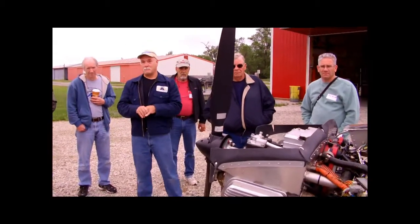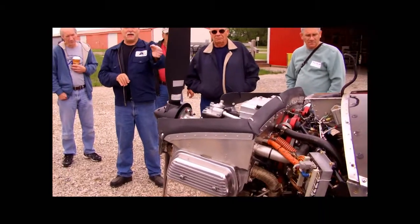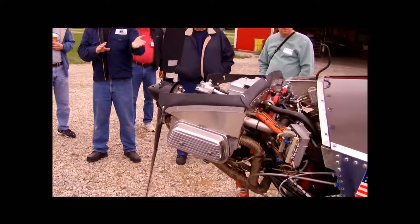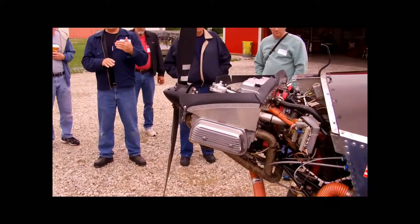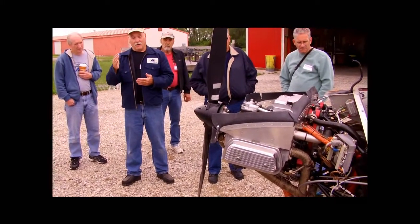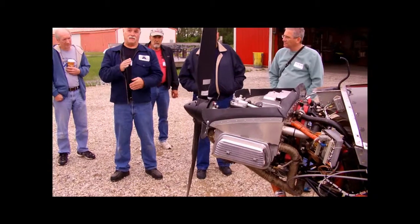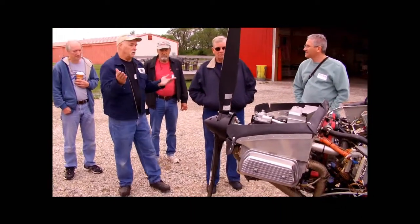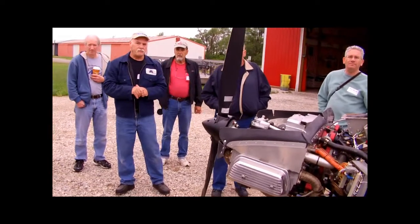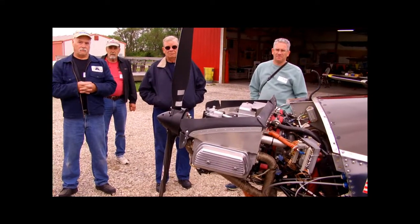Have you tried turning off your electronic ignition? Yes, I've done that. The factory timing says the number 2 is fixed — you can't do anything about the secondary. The number 1 is adjustable. They recommend 10 degrees before top dead center, with the secondary running at 28 degrees. I haven't figured out how 10 degrees makes any difference if you've already ignited the fuel 18 degrees before that. I had cylinder head problems with number 3 until I turned off the electronic ignition. So now after I get my initial climb, I turn it off and leave it off.